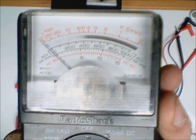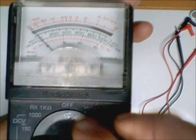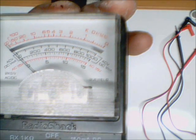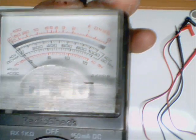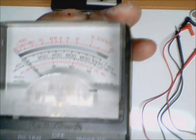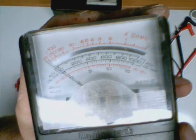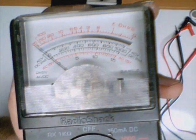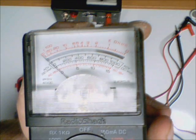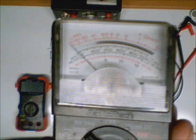The scale changes as you change your range. Now as I change my multimeter to 150, that bottom scale then has a zero added to each number — so 5 would be 50, 10 would be 100, and 15 would be 150. If we move on to 1,000, you'd use the scale which is 0 to 1,000 volts. A lot of you will not be playing with 1,000 volts DC, so you can ignore that for now.